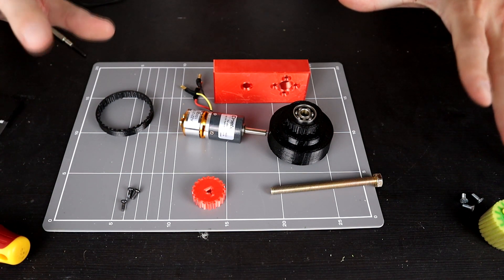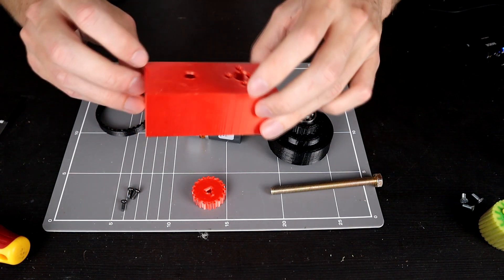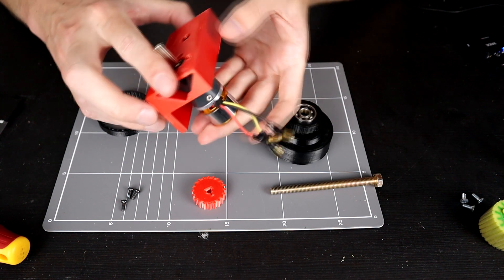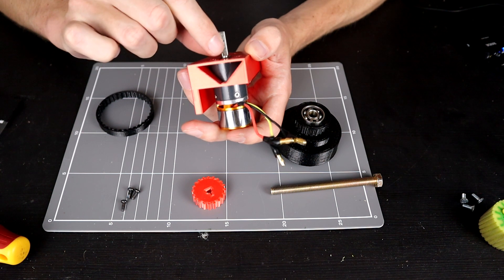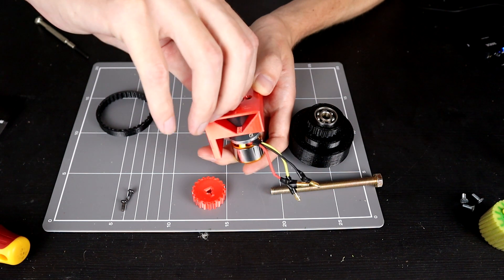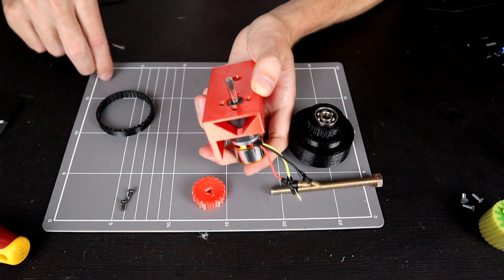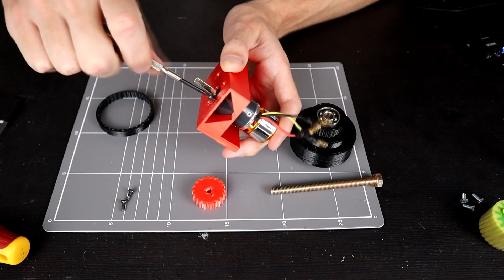So here is why we've taken apart Move basically as early as we have. This here is a test print for part of this featherweight — specifically the motor and wheel mounting — because I don't want to have just the output shaft of these be the thing holding an entire featherweight on its own. I think that's basically just gonna break it. So I have designed a pulley system so that the actual weight of the robot is sitting on an M8 shaft instead of this 6mm shaft — and it's not threaded, so it's not an M6.